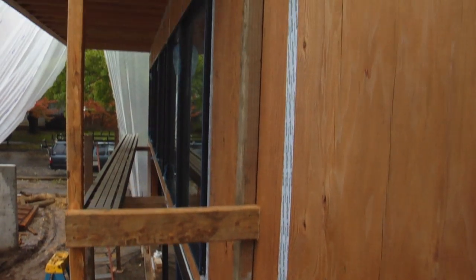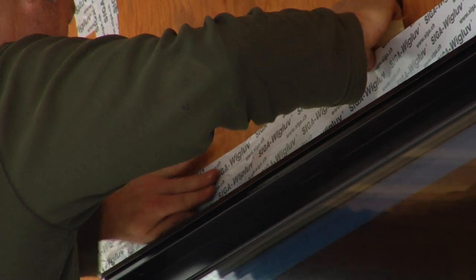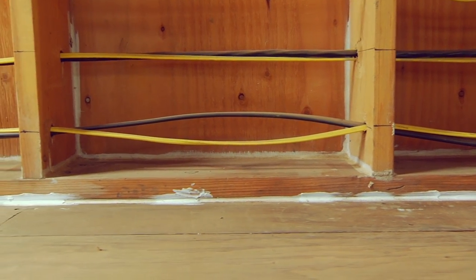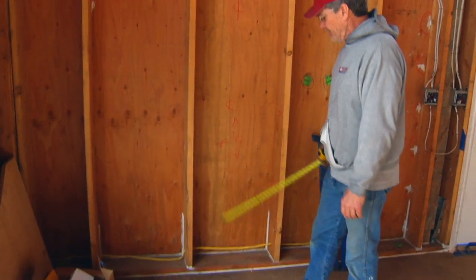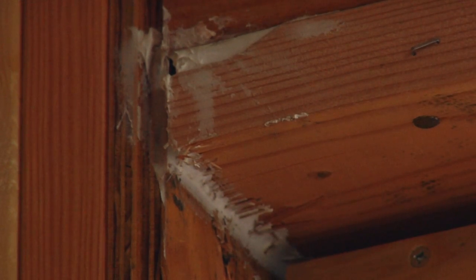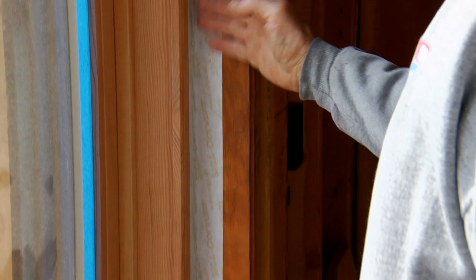In this house, our air seal is the plywood shear wall on the outside of the frame wall — that's our envelope. Every seam on that plywood is seal-taped to stop air from leaking through. On the inside, around the floor, in addition to gaskets underneath, we also have acoustical caulking and draft sealant applied around the studs. We've used up to five different methods to stop air leakage. Wherever we think there's any possibility of a leak, we seal it with seal tape, caulking, draft sealant, or foam — probably five or six different products in here.